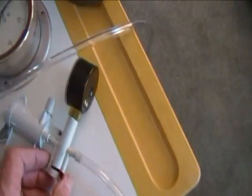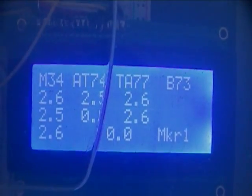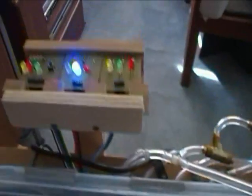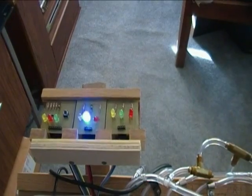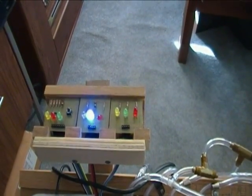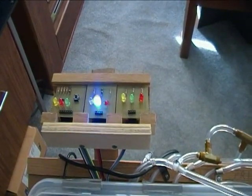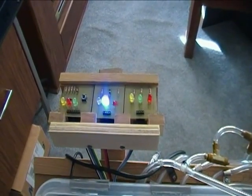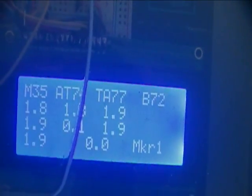I can add a leak here with this little lever. This is going to be the second sensor — the one reading 2.5 right now. The white light just went off and the blue light went on. The whole idea is I can be all the way across the room running the generator or whatever and get a general idea of the vacuum without having to walk up and read the LCD. Of course all of this is being recorded.